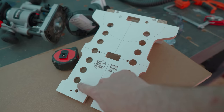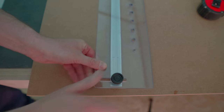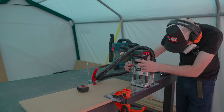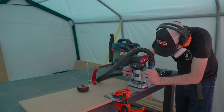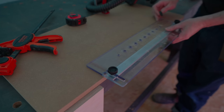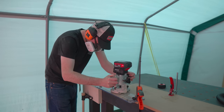All the mortises are cut, but before I put it together I'm going to put some shelf pins in. Peter's jig actually has the facility to cut shelf pins, but I've got this one from Trend so I'm going to use that. You can adjust how far you want them in from the edge — I'm going to go for 30mm. I get it clamped down, then I swap out the guide bush in the router and start cutting. You just move the router to the hole and plunge down. When you get to the end you can move the jig along and put one of these plastic pins in to change the position. I'll put a link below to this jig, Peter's jig, and the router I've used.